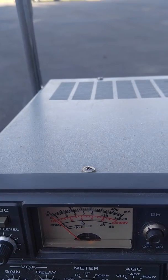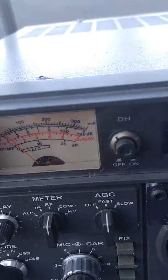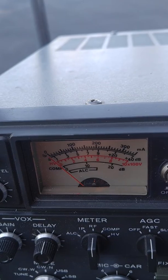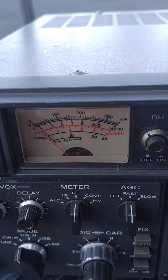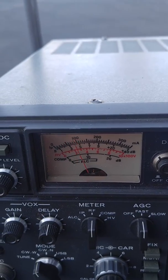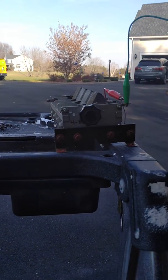If I turn the antenna and then null it — that means you can get rid of offending noise, static or whatever, if it's a single-point source, very easily. And now I'll tune the capacitor again and then turn the antenna back in the right direction.